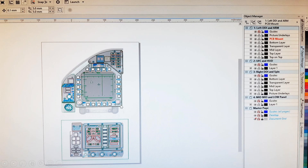Before creating the panel itself I need cutout drawings so my laser cutter can cut the acrylics accordingly. Here is an example of the drawing for the front panel. I separate several panels so I can easily duplicate or adjust them into the panel box later on — here is the DDI left, DDI, the left warning panels, armament panels, integrated fuel and engine indicator, jettison panels, and the video panel. These panels are created individually, not attached to each other.